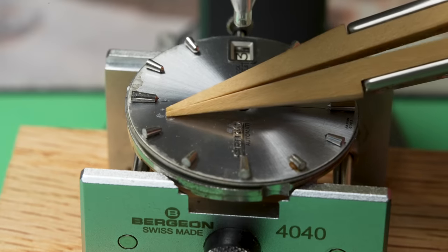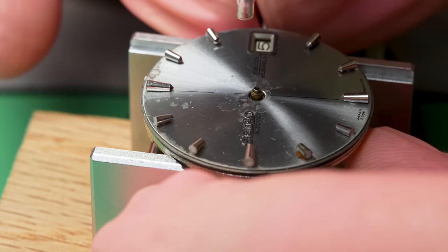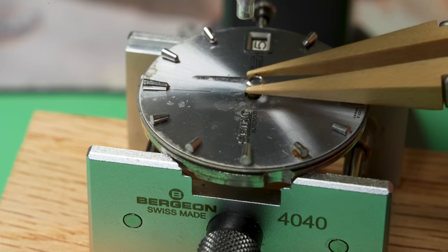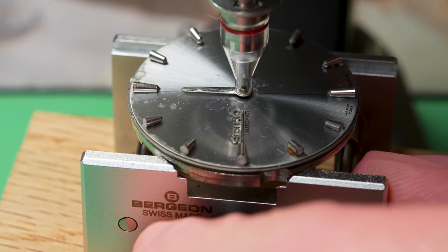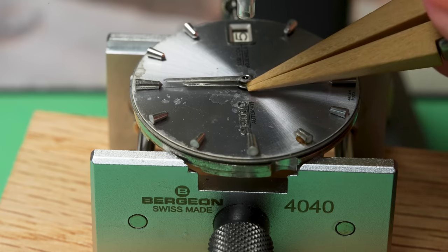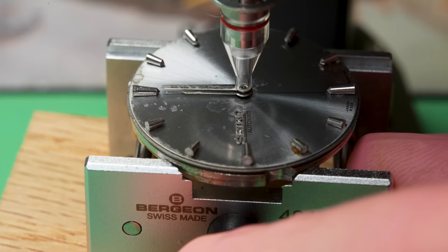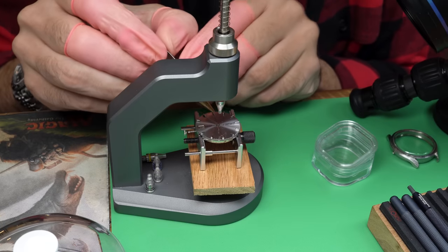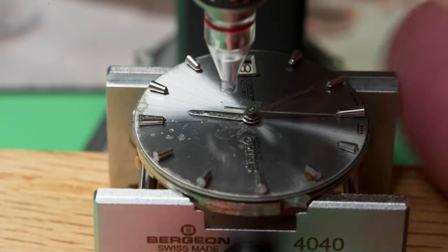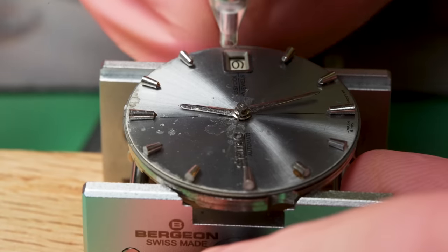That means we can put the dial back on, and the index is holding on very nicely — so I'm happy about that. Now the first thing we need to do, since this is a calendar watch, is to wind or set the hands forward right up until they switch over at midnight, because that's when the watch indicates it's gone from one day to the next. When I put the hands on the watch, I have to put them on at midnight because that's when I want the calendar to tick over. On non-calendar watches you can put them on any hour, lined up perfectly, and you're good to go — but on calendar watches you actually have to think ahead a little bit. Okay — hour hand on, minute hand on, and now the seconds hand can go on — just a little gentle push to make sure it's seated properly.